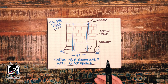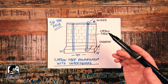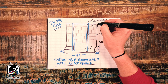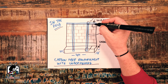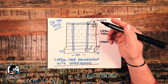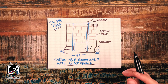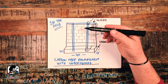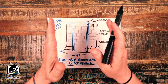And then lastly, we re-installed the concrete floor. From the outside of the foundation wall, we cut open the top course of cinder block within the damaged portion of the foundation wall. We do this to essentially expose the interior cavities themselves. Then we fill these block cavities with grout, which functions as a reinforcement strategy to make hollow cinder block essentially a solid concrete wall within the repair area.